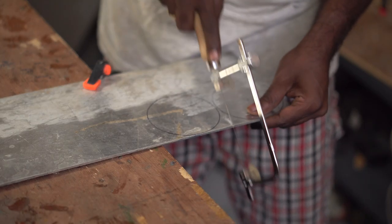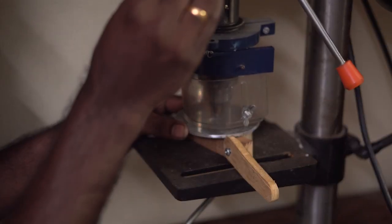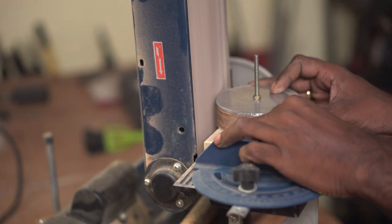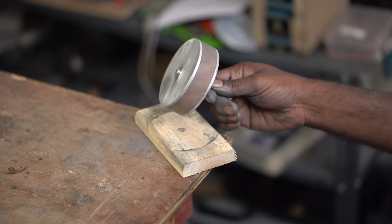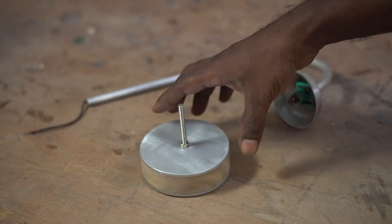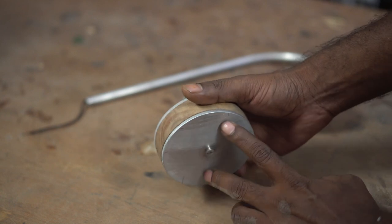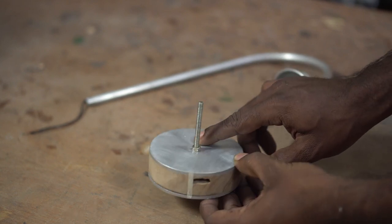The plates are 3mm in thickness and a coping saw can be used to cut them out. Then I drill the holes on these two plates. The wooden base was sandwiched between the aluminium plates and bolted securely. Since I was looking for a flush and smooth fit, this setup was sanded down using a belt sander. Then various grits of sandpaper from 120 grit to 400 grit were used to smoothen the surface and edges. Although it looks like a perfect circle, it is not. Once I remove the bolt, it may not align properly, so I put tape to align it later. While the bolt is still on, I'll make holes in the bottom for alignment, and make a hole in the top for the switch.